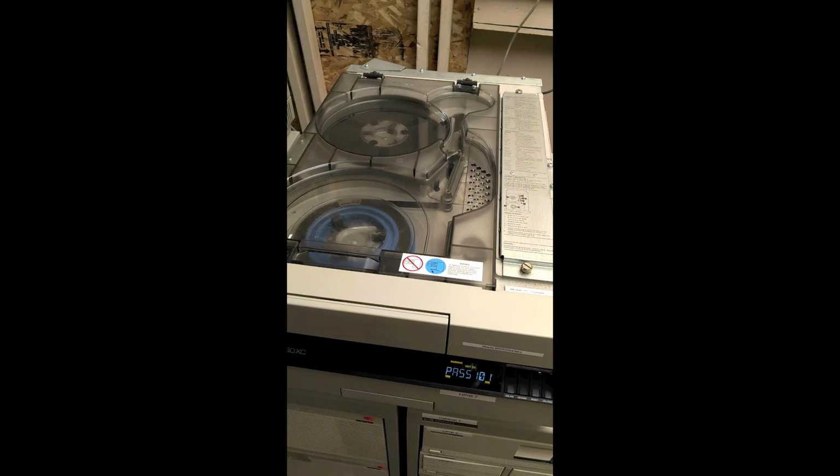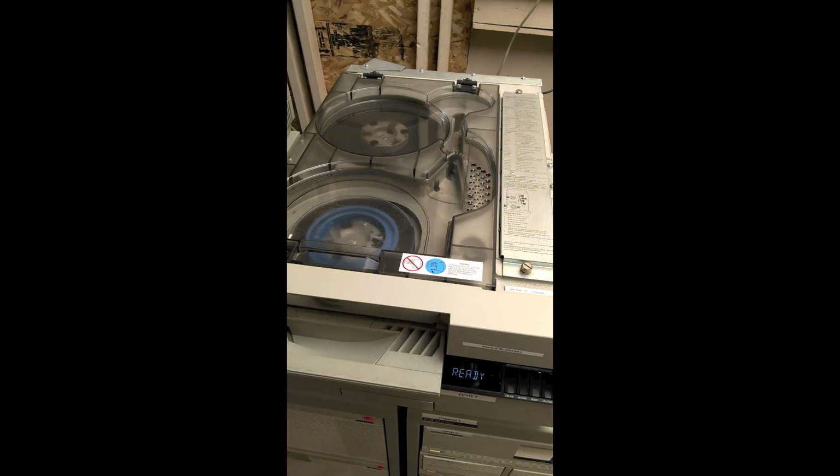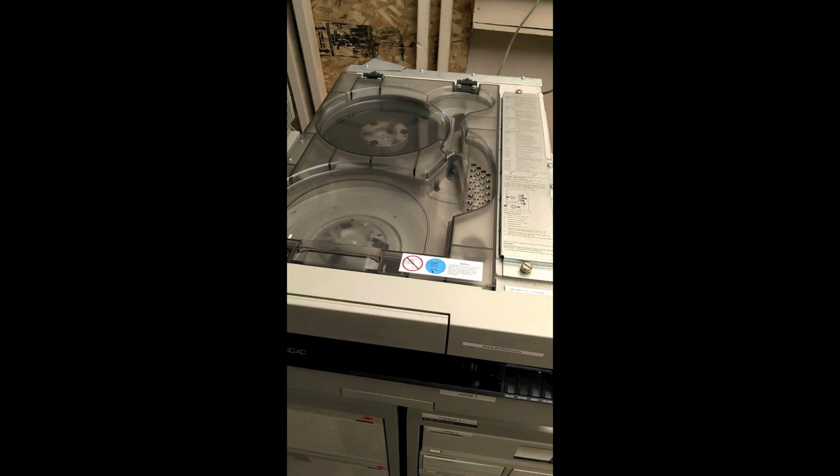and then that's done. So usually what would happen is if the tape was being used by a program or a job on the system, there'd be a command issued from your program saying, I'm done with the tape, go ahead and unload it. And what would happen is the tape would unload, the door would pop open, the operator would know, okay, the program is done with this job, so I can take this tape out now and either mount the next tape or just close the door and wait until the next job needed the tape.